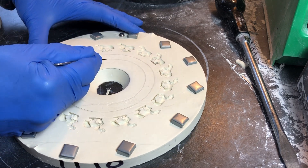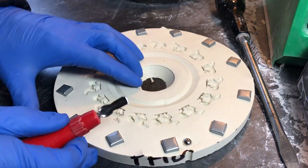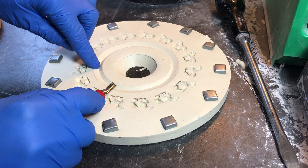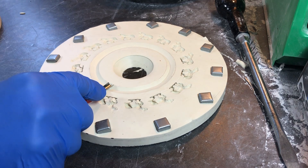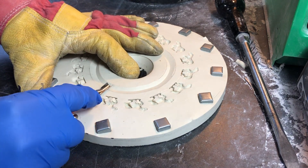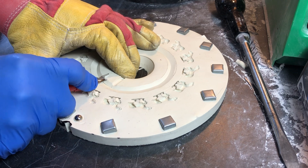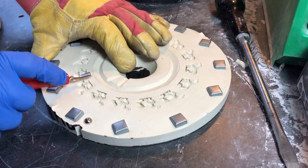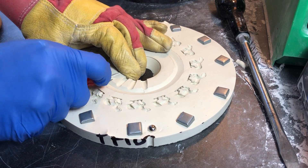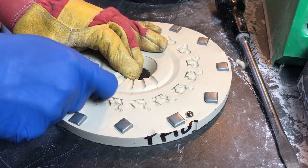Obviously not trying to cut through the mould, otherwise it won't be much use. That's got through to the end and then you should be able to pull it out. Then cut the feeds again — I cut them between the figures so the metal technically flows up there and then round that way when you're casting. I'm putting my leather glove on so I'm not ramming the sharp edge of a lino cutter into my finger, because you need a bit of resistance. You can get mould or gate forms that do the job for you, but because moulds are all different I've never found them very useful.